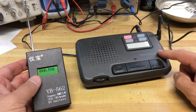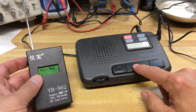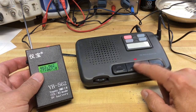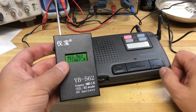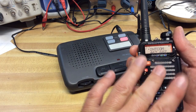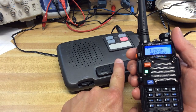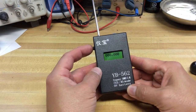I have several frequency counters. Let's try an in-house intercom system that operates on the FRS frequencies here. There it is — 462.5625. And it has a tone of 67 Hz. That way these intercoms don't pick up all kinds of other interference. That means I can program my handheld HT to operate with the intercom around the house, and that works fine — thanks to me decoding that tone I could put it in my HT.